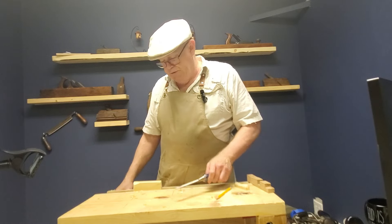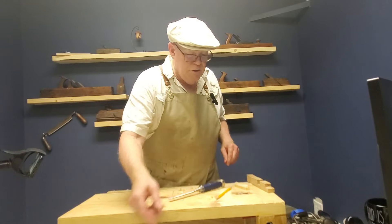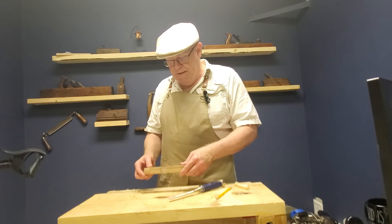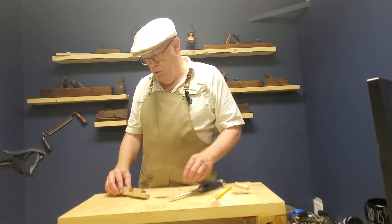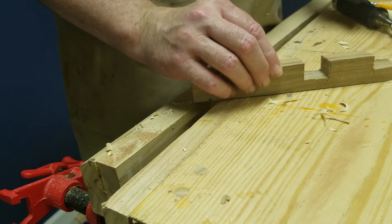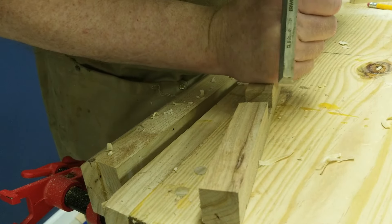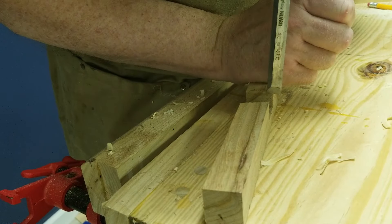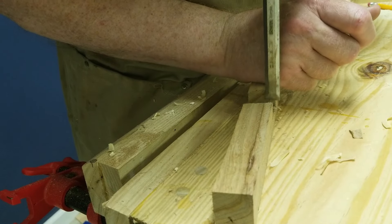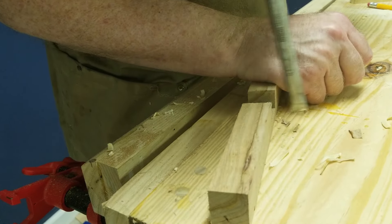What are some of the practical applications of this? Why do we need to know these? These chisel strokes are actually very important for future exercises such as half laps, dados, bridle joints, and things like that. As you cut your piece, you should stay away from your line just a little bit so that you can sneak up on it. We're actually off the line just a little bit here, so you can come in with your vertical or perpendicular paring cut and trim that down. Make sure there's always a piece of wood between you and any body part, because this could be quite painful.